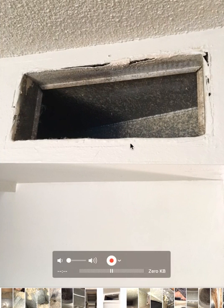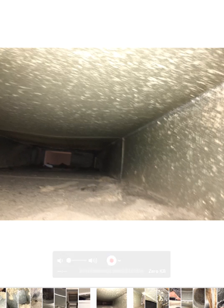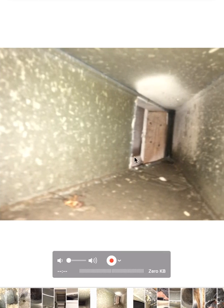This is where the trunk line in the home — maybe the attic wasn't accessible — so I pulled the register here so that you can see duct leak issues. I'm going to get pictures from inside of here. This is that same type of seam that we take a picture of from inside the attic. Here's what it looks like from inside of the duct system from inside of the house. We want to get pictures of this kind of stuff.